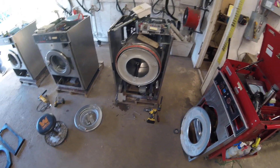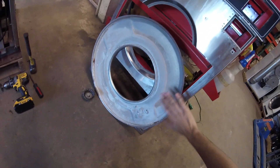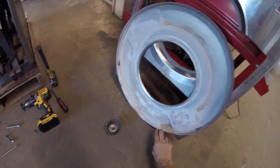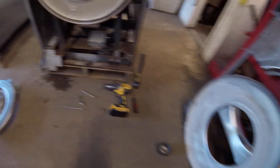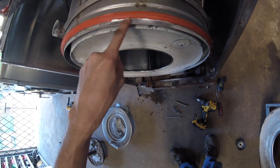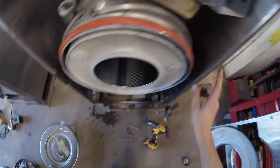Now, once you have these off, one of the most critical things with rebuilding these machines is that everything has to be clean — you can't seal it if it's dirty. With this plate, it works well to put it on top of a trash can to hold it. Use the grinder with the cup wire wheel and do a good job polishing this edge all the way around — it should be very shiny, because it needs to seal there. Then with your drill with the wire wheel on the end, go around and clean this edge very well. If your foam is coming apart, just rip the whole thing off and polish the entire edge all the way around.